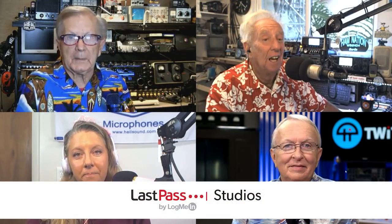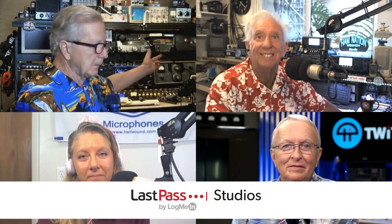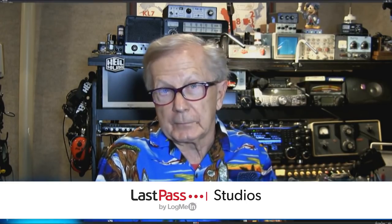Oh, goodness. Well, this brings some great questions out, though, Bob. You were talking all about PL259, so I'm going to assume that's your go-to connector. You'd prefer that over the N connector any day, right? Well, it depends. I have N connectors, and on the back of my 2000, you've got to have an N connector. If it's called for, N connectors, yeah, that's a little bit different situation. But it's not that I prefer them. It's what the piece of equipment calls for.